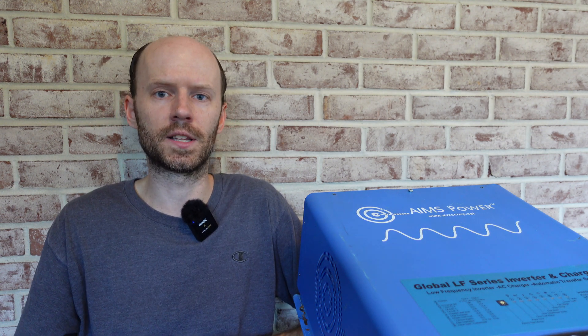First instinct would be there's probably a loose connection somewhere — a wire nut, a loose lug, something that needs to be tightened. I've been over all the cabling at this point many times, both DC and AC, inside and outside of this unit. There are no loose connections. A number of you in the update video suggested there may be a problem with the capacitors in this inverter, which makes perfect sense and isn't really something I had thought about at first.